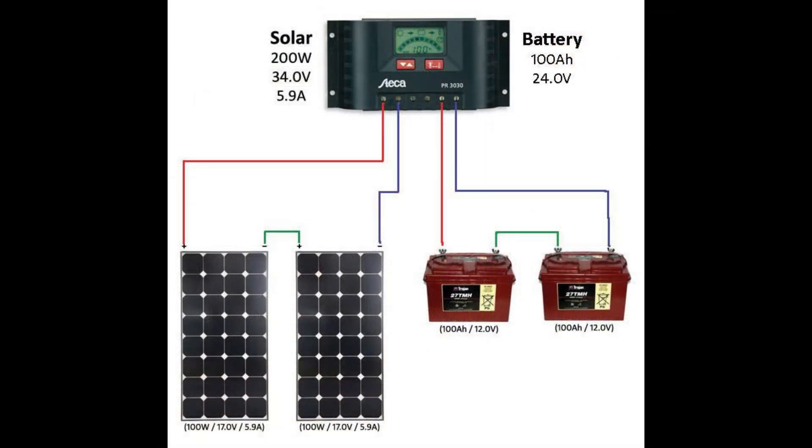There is also line loss — a voltage drop that occurs. If you're placing your batteries farther away from your solar setup, the amount and size of cabling has to be altered in order to maintain 12 volts at the other end. When I built mine, I chose — because of budget — to purchase a 24-volt system. The upside is you can add more paneling for the same charge controller amperage. But you're stuck using a step-down converter if you want to run a direct 12-volt item off your system. For home installations, that's not that big of a deal.